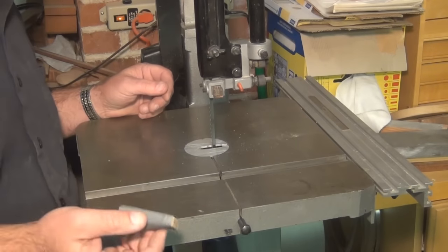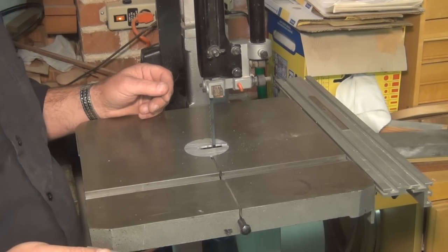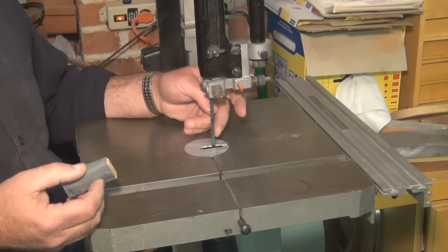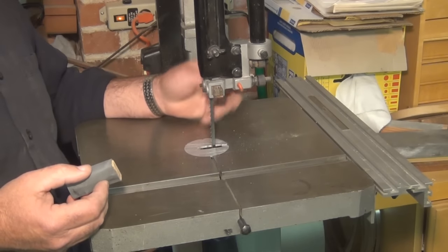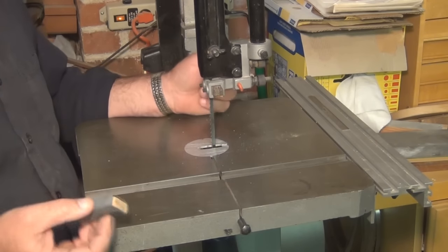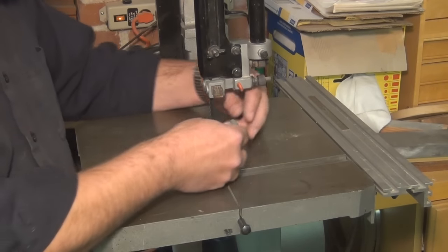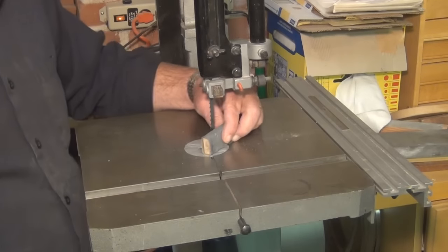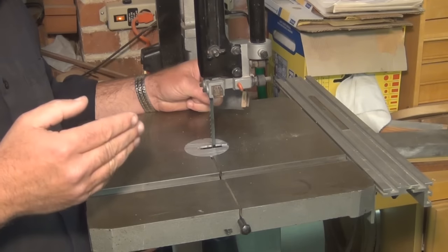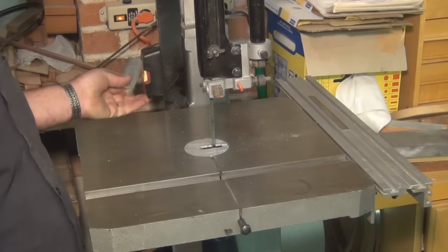And then here's another thing, again, your comfort level, your safety, if you're going to do something like this. Many of the really good blade manufacturers will already have eased the backside of the blade. But there's a lot of inexpensive blades out there, and sometimes you've got a little manufacturing burr on the backside of the blade. I've got some 400 grit sandpaper here on a little block, and while the machine is running, I can soften that back edge. That can help sometimes with tight cuts and so that the back doesn't hang up so easily.